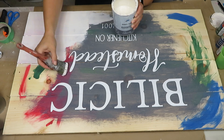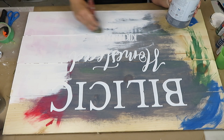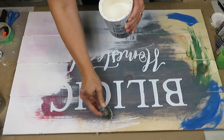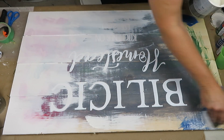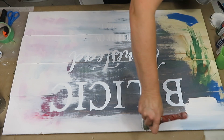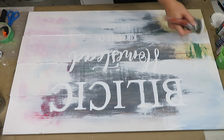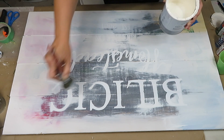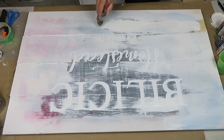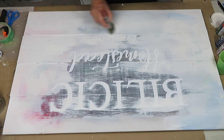Painting over red, you will always have a little bit of bleeding through. I was okay with it in this case — you'll see why at the end — but just a heads up: red paint does tend to bleed even through chalk paint. There are primers you can buy to prevent that, or paint over with black first and then white. I'm going heavy on the sides but lighter in the middle for more of a brushed look rather than solid color.